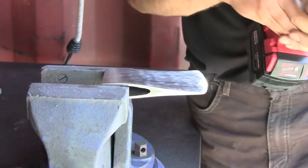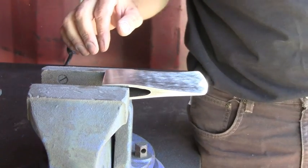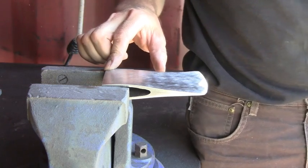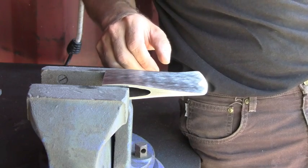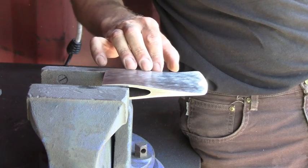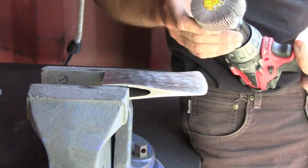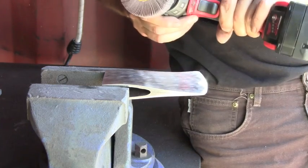All right, I think I got all the deep grooves and the pits. I thought this axe was in good shape, but once you start sanding, it's incredible how deep those pits go. I've been grinding for about 2 hours with the flap disc. Yes, I could have used a regular grinder, but the problem with that is that the metal can get so hot that you can damage the temper of the steel. Also, you can get really deep gouges in there, so I prefer just taking my time using the flap wheel. Works great, 40 grit. Now I'm jumping to the flap wheel, 120 grit.